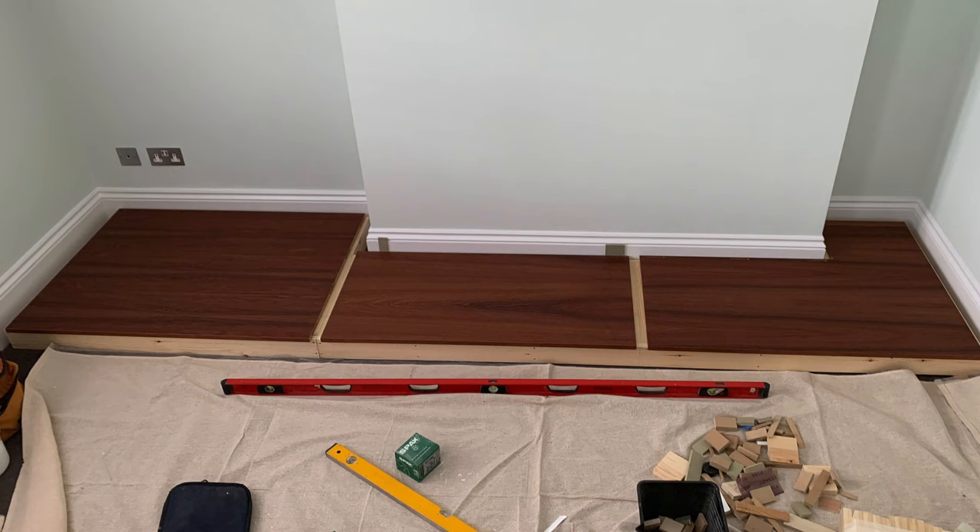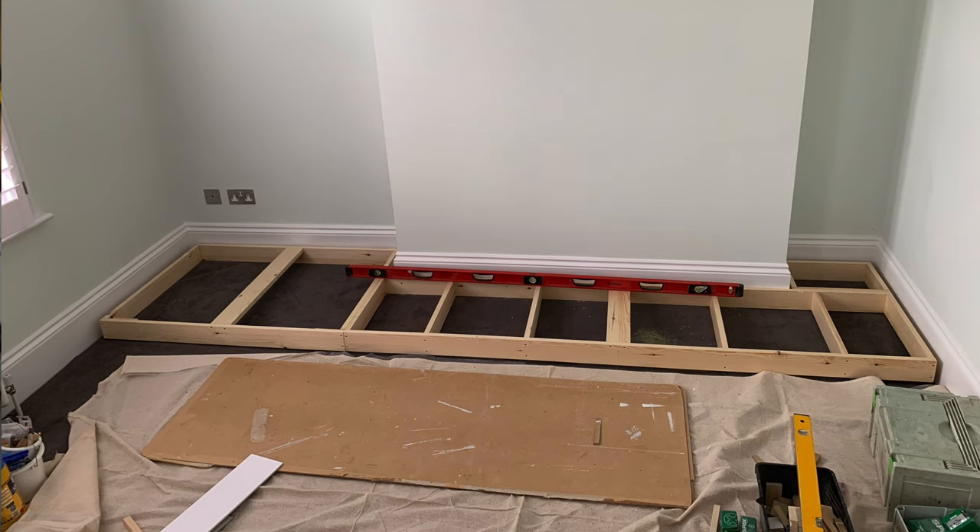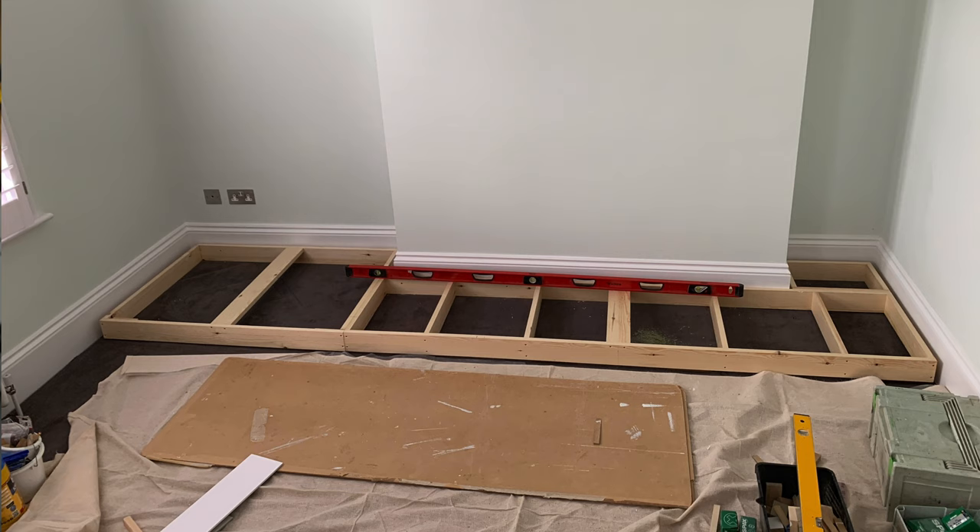I lay out the bases of the carcasses onto the plinth, just like I did in the workshop, to get a visual check of how they look in the space. To be safe I ease the plinth and carcasses a little to the right to give a bit more clearance — only about 12 or 15mm — but this means the infills will be slightly uneven, wider on the left than the right. I'd rather have that than have the doors clash against the window shutters. Once leveled I fix the plinth to the skirting boards at the rear and at the front with small wooden legs screwed to the inside of the plinth.